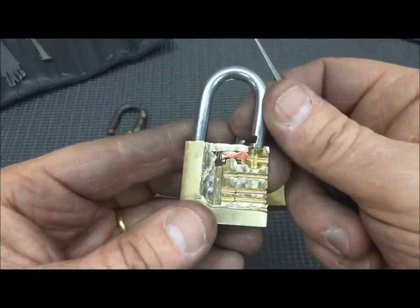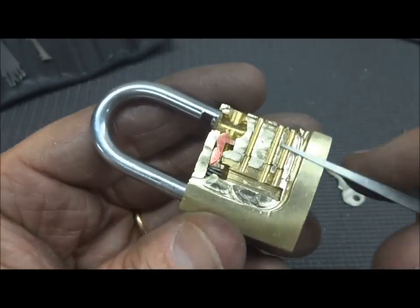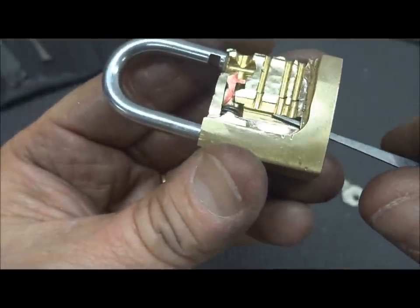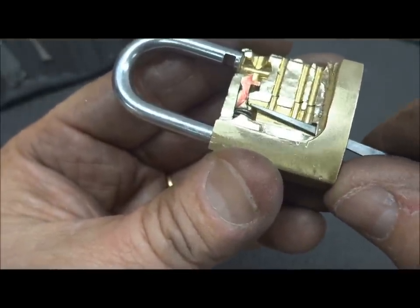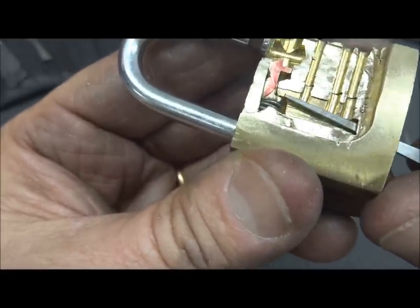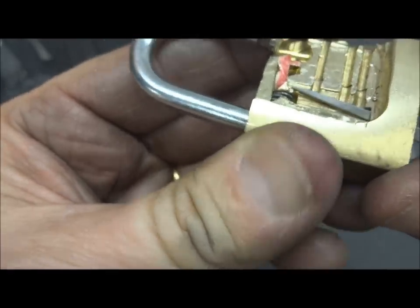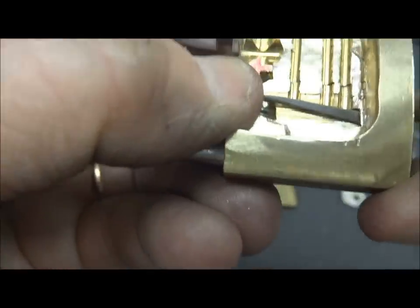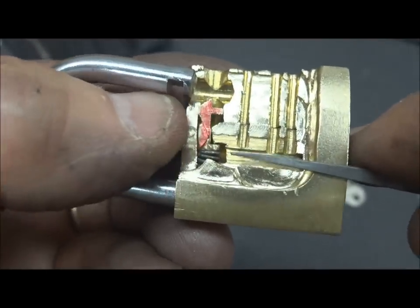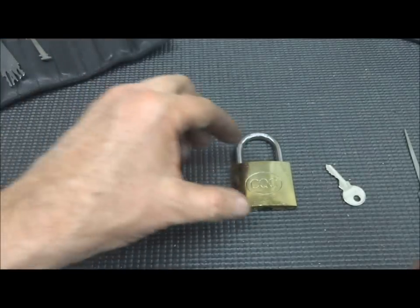It works the same way on this little jar lock — this one got mangled a little worse, but I did it on purpose. Again, we have the red-colored locking pawl. We're coming in through the keyhole, and I machined it all the way down to the key so you can see this is going through what's called the broaching — the keyhole. We go in there, grab hold of it with the knife, and simply lever it out of the way. So that's how that works — unshielded padlocks, no magic to them.